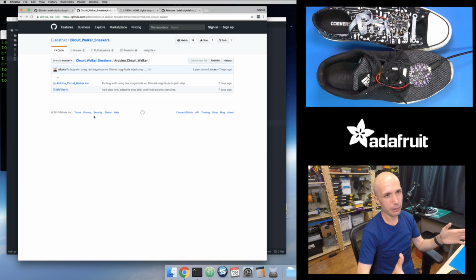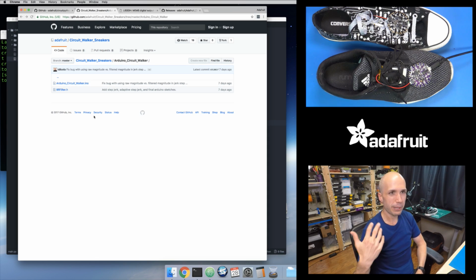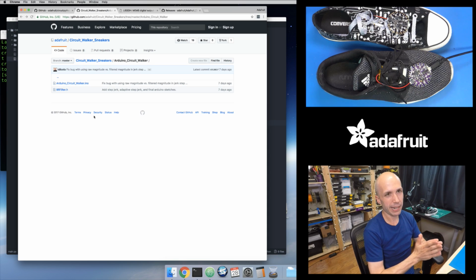But then the tricky thing is there's a limit: if I sample 10 times a second, I can only filter and deal with a signal that's half that sample rate, so 5 times a second. So it effectively means I can only deal with a signal that's at most, if I'm sampling 10 times a second, 5 times a second. And that just means the more time I have to spend doing that filtering and computations, the less time I have to grab samples. Basically the slower my sampling gets. And if I can't sample at least 6 times a second, then I'm not going to be able to detect a 3 hertz signal. And that's going to throw a wrench into everything: I'm not sampling fast enough, I'm not able to filter fast enough, and everything falls apart because of that.